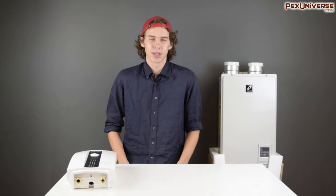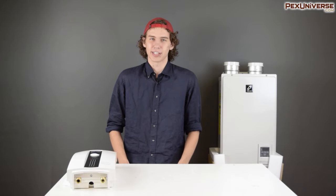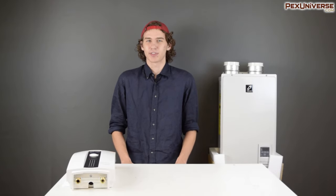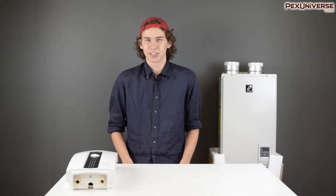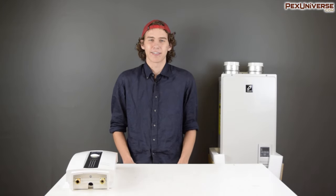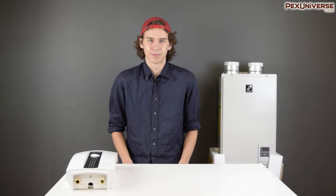So how do you go about selecting a tankless water heater? The biggest decision is how it heats your water — gas or electricity. There are a ton of factors to consider, but we've got all the information for you to make the right decision. The first thing to consider is installation price. Gas water heaters are generally going to cost you more for the unit itself, and combine that with the need for a gas line and a ventilation line — an electric water heater is generally going to save you money up front.